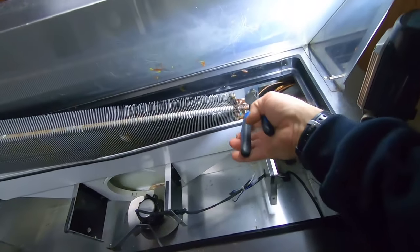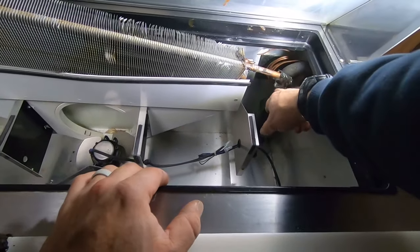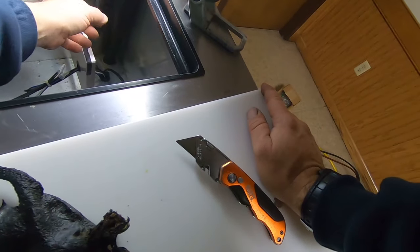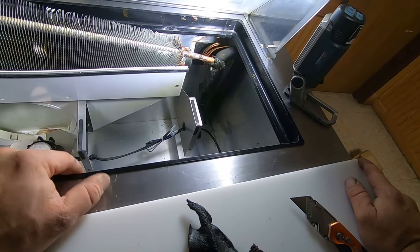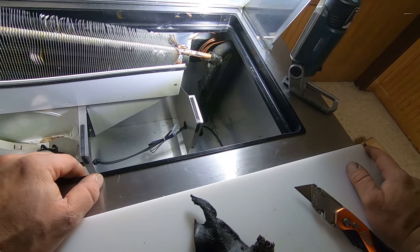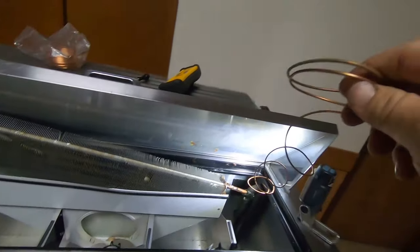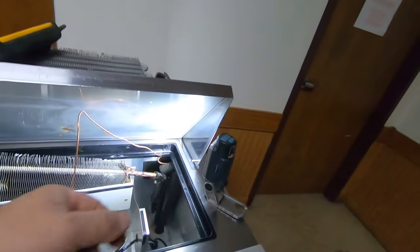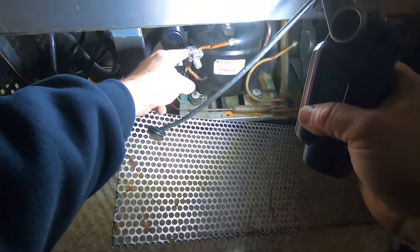Go ahead and get our cap tube cut. This little bulb over here, that's your accumulator—it's just a copper pipe with one tube going down, one coming out. It's kind of almost something you could easily make yourself; it's just something the factories do that helps give it a little extra protection. This will be an easy one to change. As far as cap tube is concerned, it just gets attached to the suction line here for barely a foot. Junk clamp-on taps—that'll be gone before I'm done.